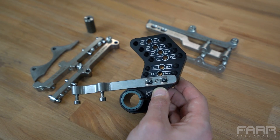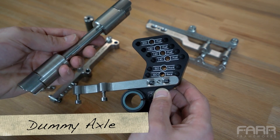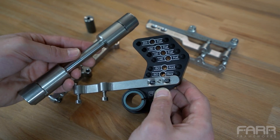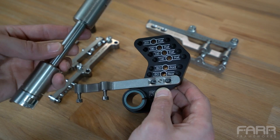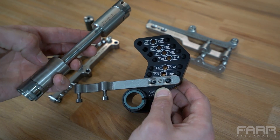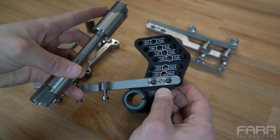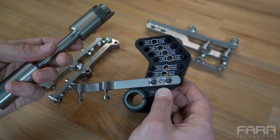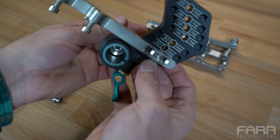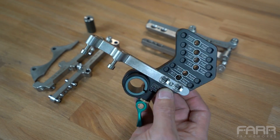This attaches to the frame during construction with another tool called the dummy axle. You can buy these from me or from Paragon Machine Works — I'll link both down in the description below. It's a very common tool that's been used for a long time. It basically simulates the hub spacing of a particular frame and makes sure that the dropouts are correctly spaced at that distance. My tool mounts directly on the shaft of the dummy axle, which I'll show a little bit later.